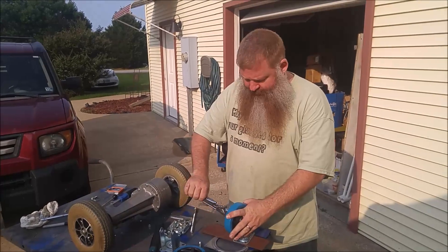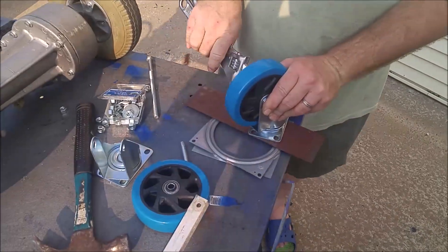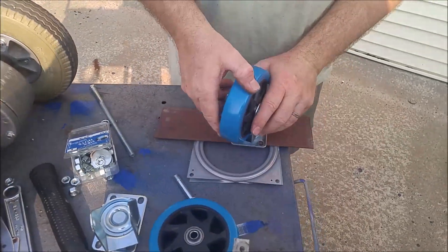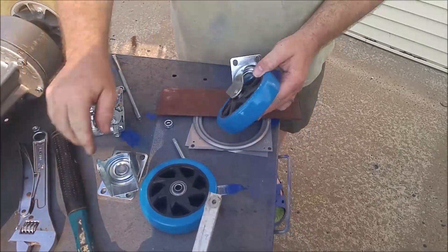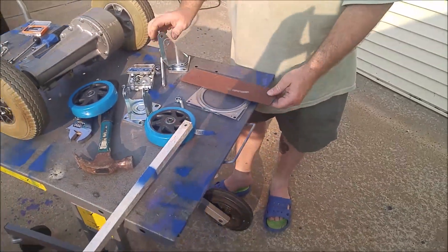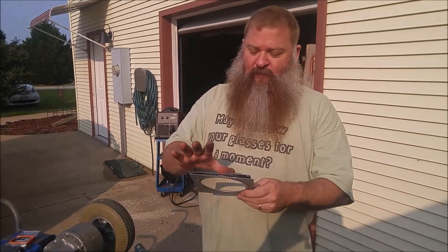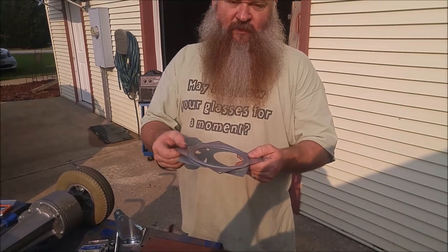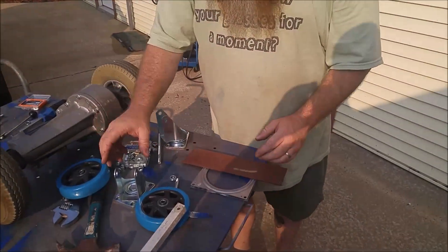While we're waiting for paint to dry, I'll start assembling the steering mechanism. I've got these casters — I'm taking them apart and we're going to bolt them together to make a fixed axle. We've got this eighth-inch steel; I'm going to cut it into six-inch pieces to cover this plate and reinforce it, because it's too thin and too weak as it is. This is the heart of the steering mechanism.